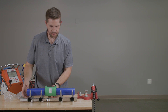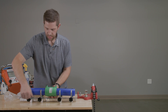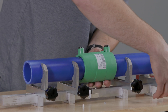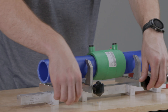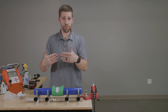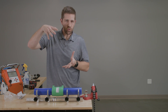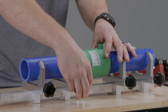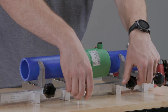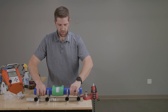Now that I've got it marked and cleaned, I'm going to go ahead and place the pipe and the fitting in an alignment jig. When you're doing Electrofusion, it's very important to use these alignment jigs because as the components heat up, you need the support of the alignment jig to hold them in proper alignment and hold them isolated and still while that material heats up, cools down, and fuses. If you don't hold it in an alignment jig, it's possible for the pipe or fitting to shift during the fusion process, which could disrupt the new bonds that are forming. So we'll get this placed and tightened in here so that it can't move.